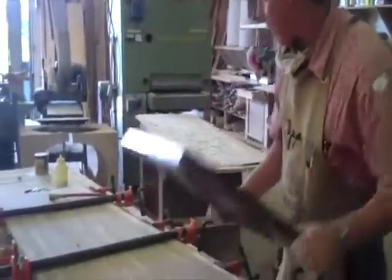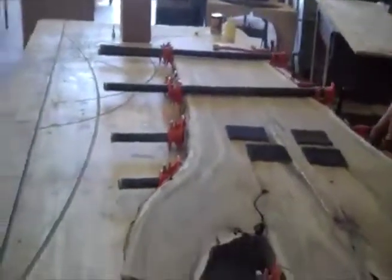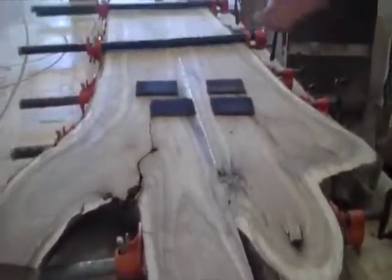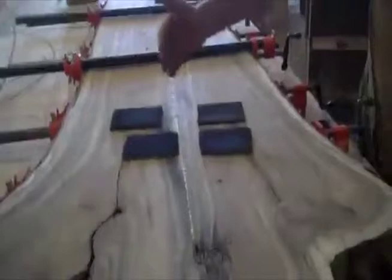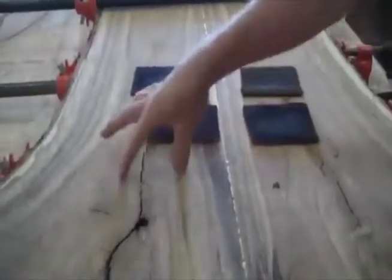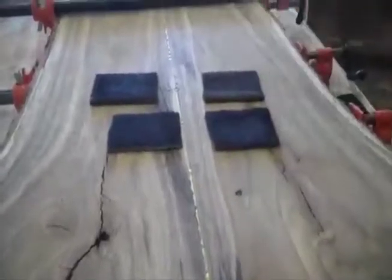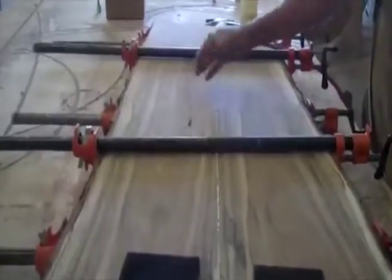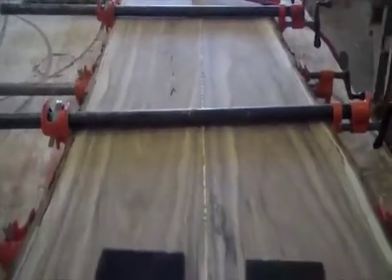What's going on here is I've got two slices of a scrub oak tree — they're not exactly bookmatched, but they're pretty close. They're put together so I can get enough width. You can see there are a lot of inclusions, and this is a crotch here that's lost a lot of integrity as well. I'll put some bow ties or butterflies in here to hold that together, and where there are splits and other inclusions, that will have to have some dark epoxy poured in there to give it some integrity back.